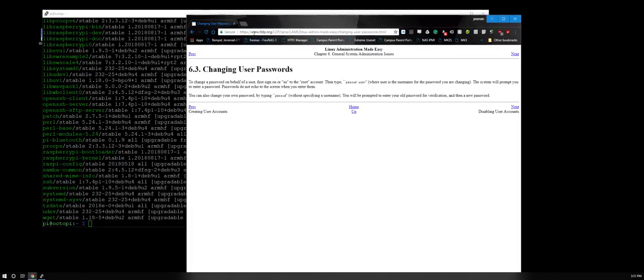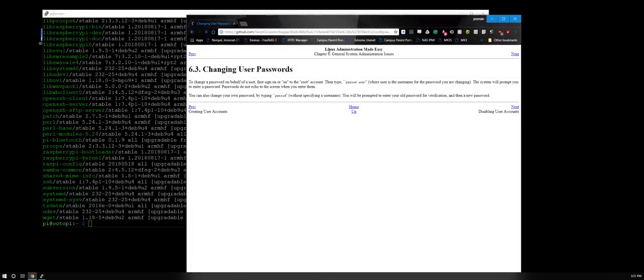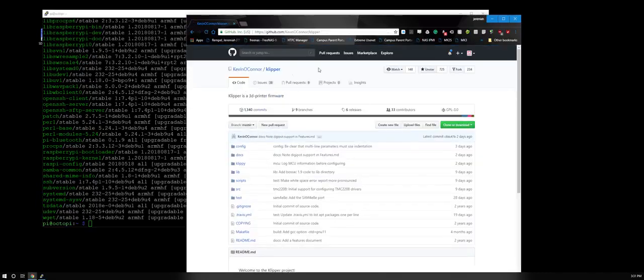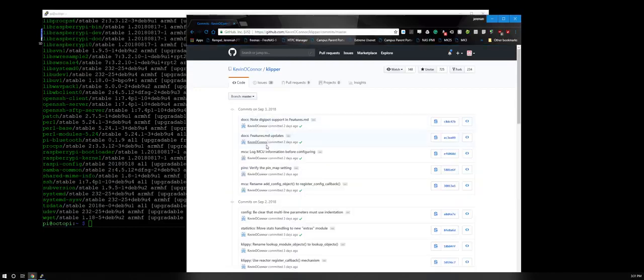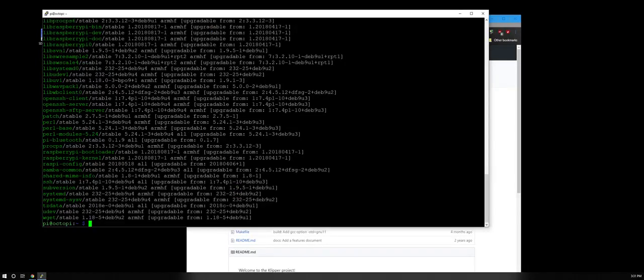What we will do is we will go to Klipper. I've been there a few times. I'm going to go to the main Klipper page. Just real quick, I'm going to see. Oh, we've gotten some updates the last couple days. We want to clone download. We want to copy this link to our clipboard. We'll come here and we will do a git clone. And that link.